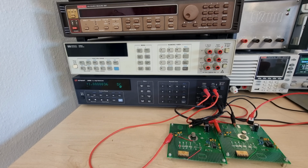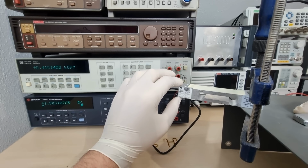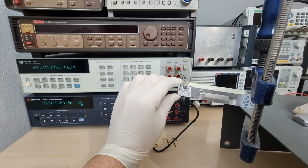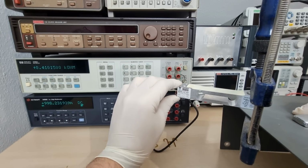Internally, this is done by 4 separate ADC conversions, 1 per terminal, and some number crunching. Of course, it's also very useful to compare resistances, if they are in a bridge configuration or if you have 2 very well matched current sources at hand. Here I'm using the HP meter as a current source. I'm calling this the interratio configuration.